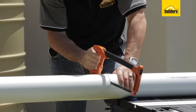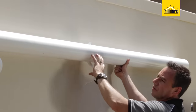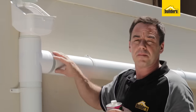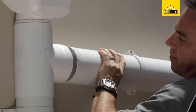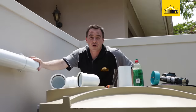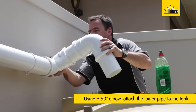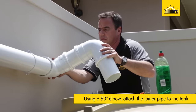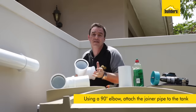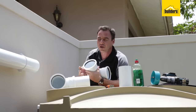It's really handy making use of a mobile workstation — it just makes life easier when doing DIY. Before you fasten the holder bats tight, I'm going to put some PVC glue on the end of this pipe and just join these two mating surfaces. We've got our 110 pipe firmly fixed in place.